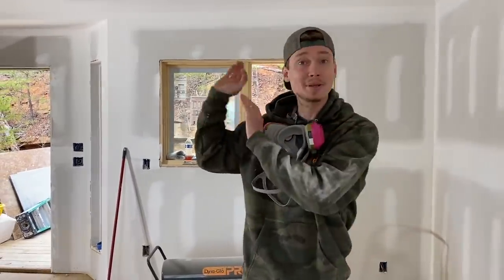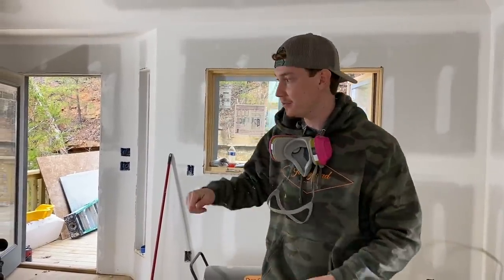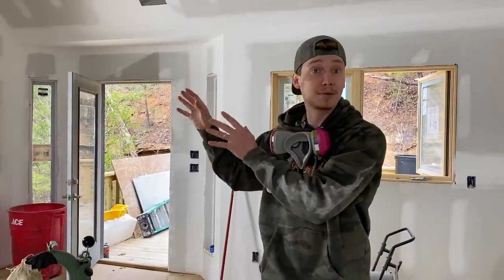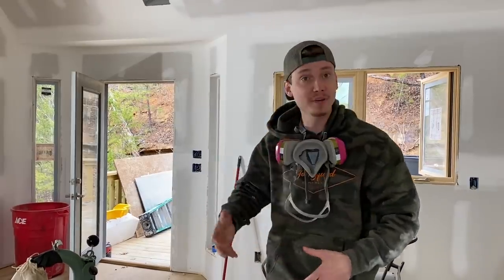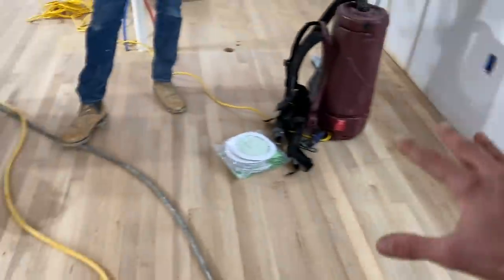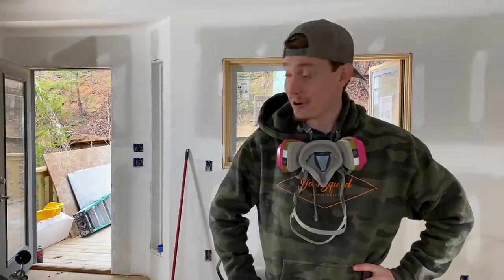The next thing is probably the master bedroom, and we're going to take a little bit different approach to this. Instead of roughing it and then puttying it and then fine sanding it, we're going to putty it right now after we vacuum clean it, rough it, and then putty it again, and then fine sand. Exactly. We're gonna double putty the floor because we noticed some places where we could have done a little bit better. We're gonna take a different approach, like you said, and get all the cracks and crevices completely gone, but I say we go ahead and vacuum everything up and start puttying the whole floor up.